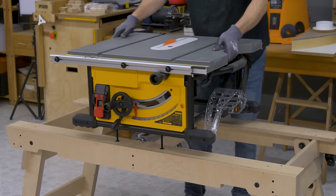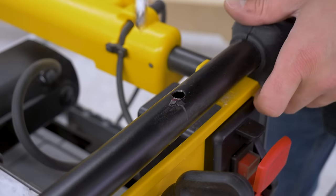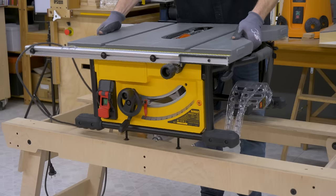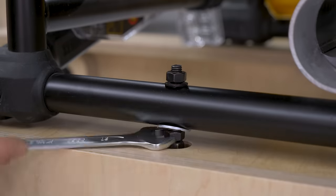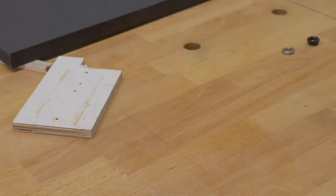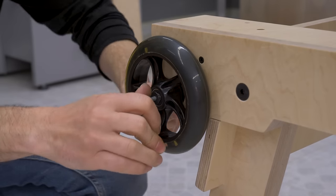I placed the bolts in the base and found a little surprise: I had measured the holes in the back of the saw and made the plans assuming the front ones would be equally spaced apart, but it turns out that's not the case — on the front, they're 10 mm further apart. To make do, I enlarged the holes in the front a little bit. Make sure you verify this on your saw before drilling holes in the base. Now all that's left is to install the bigger wheels on the front of the base. The plans include a printable template so you can make them out of plywood, but in my case I decided to buy scooter wheels. I'll use a bolt that's long enough, along with washers and a self-locking nut.